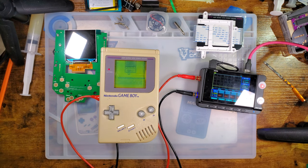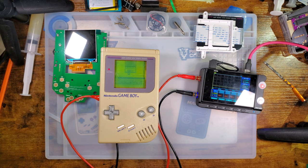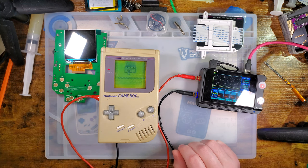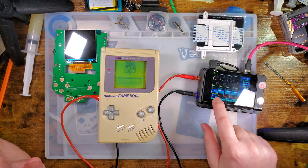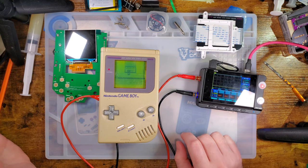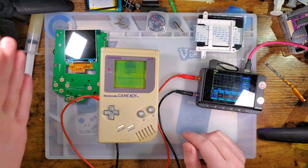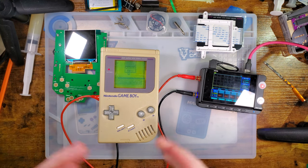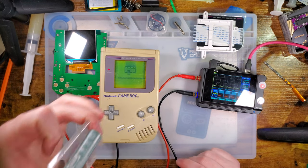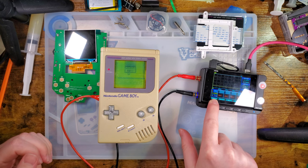In Pokemon Silver — the same game I usually always test with — at least for other Gameboys. I usually test with Pokemon Yellow for DMGs and Gameboy Pockets, but we're doing Silver today. Anyway, in the overworld, same place I always test, at 4.8 volts this console is pulling between 50 and 56 milliamps, which is pretty typical for an original Gameboy. Good to get a baseline so that when I plug in the new screen and check the power usage, we can extrapolate battery life. For example, if you get about 30 hours and it's using about 0.25 watts, you install your new screen and it starts using about 0.5 watts — you can extrapolate you'll get probably around 15 hours or less.